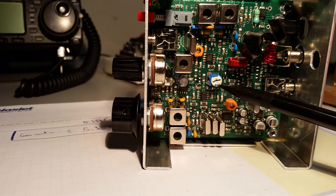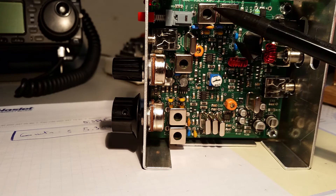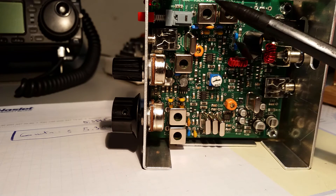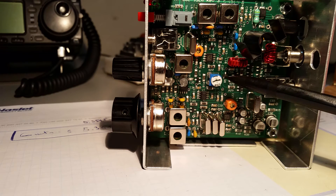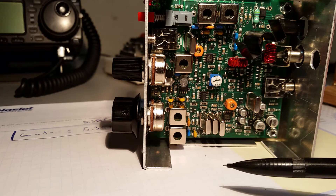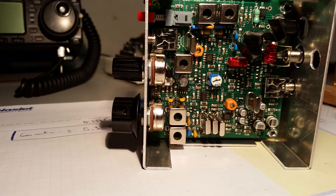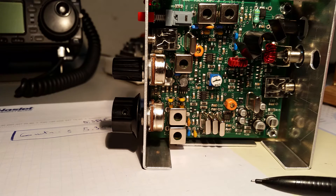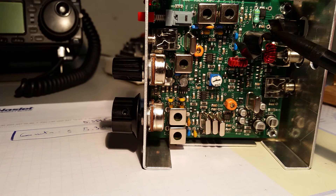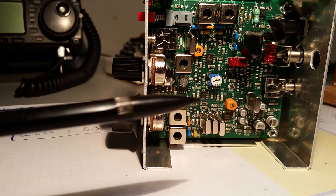The fifth is the transmit band pass filter. To do this, you set this one on maximum — turning it towards this coil — and then align these for maximum power out. Once they are optimized, you can turn this back until power starts descending. I wouldn't go to the maximum it can give. Mine gives 1.5 watts, which is not the 2.2 watts or higher promised by MFJ, but I don't have a problem with that — I'm very pleased with 1.5. MFJ also describes that you can put another transistor in here and describes which transistor to put in the kit.